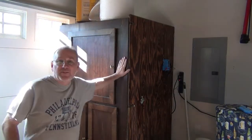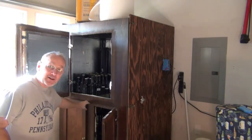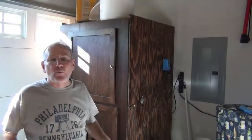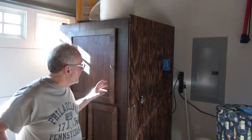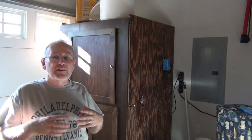Here we are — we've had this running for about a week now. I've got a bunch of beers I still need to organize down in the bottom. I'll explain on another video why it's taking me so long. One thing you want to make sure is that the lines are completely bled. If you ever get a puncture in one, we had just enough pressure to pop my little seal — it formed a bubble and popped and we had to reseal it. Not a big deal, but it still took time. The other thing we did wrong was we were given advice on where to start pressure-wise and it was too high. When you start at too high a pressure, the compressor will overheat and kick off.